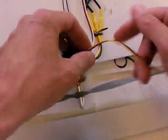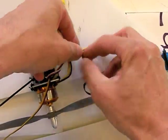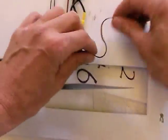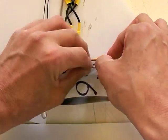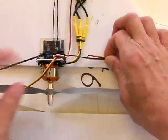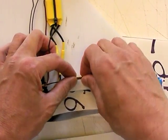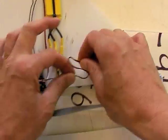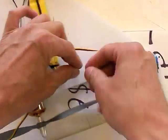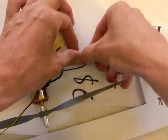This has happened many times, as you can well imagine. So what I do is just something really simple, which is just wrap them around a few times. Do not do this. This is something people always do because they think it looks cool, and it does, but it doesn't work. So they'll do that, and then put some zip ties over it, and what will happen is it'll crash or it'll get snagged or something, and this will just pull out from the zip tie, and that doesn't work. You have to do something that's a lot less attractive, which is namely wrap around a few times like this, and put a zip tie there.